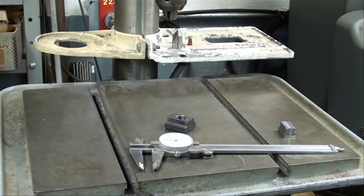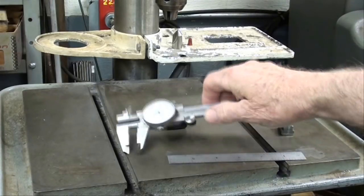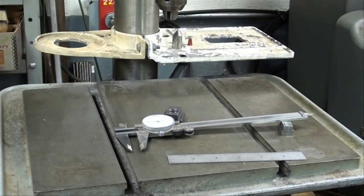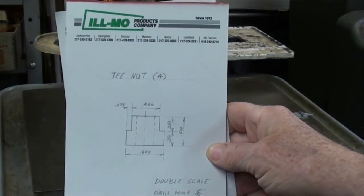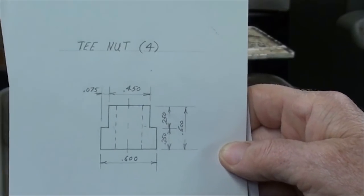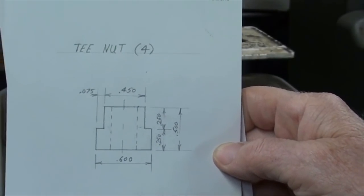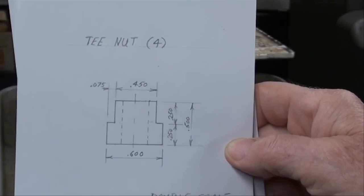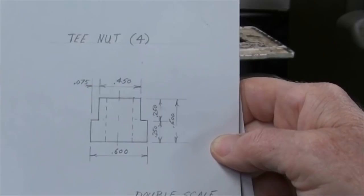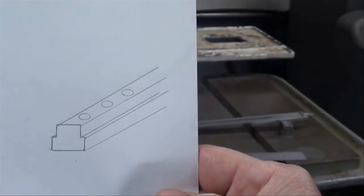The first thing I did was to take my dial calipers and my scale, and I measured the width of the slot, the depth, and the width in two places. Normally I just put a few dimensions down on paper, but for the purposes of this demonstration I made a little drawing. You can see it's six hundred thousandths at the widest dimension, and the height is five hundred thousandths, which is a half inch. This particular little sketch is drawn at double scale, and I'm going to make all five of them at one time.